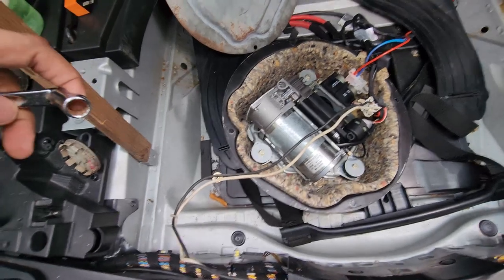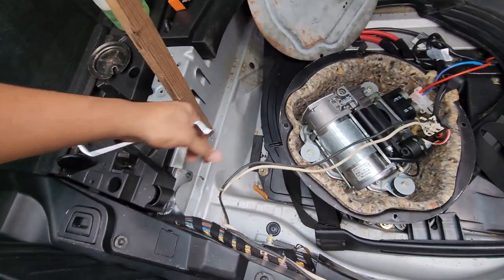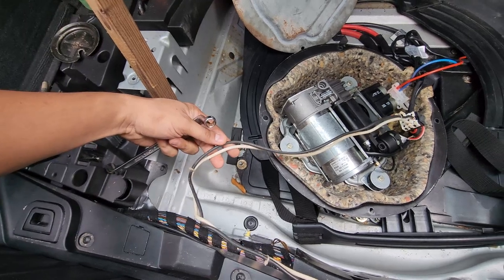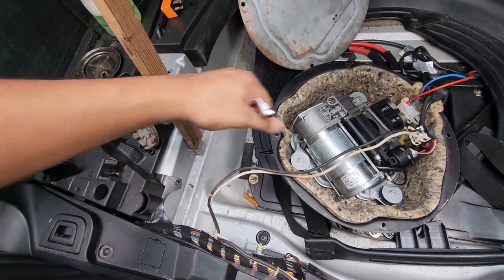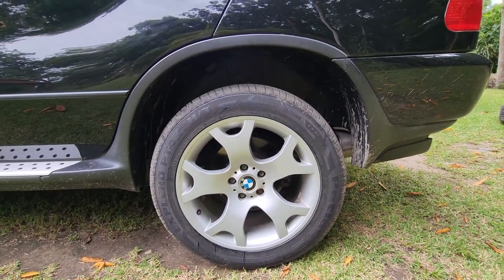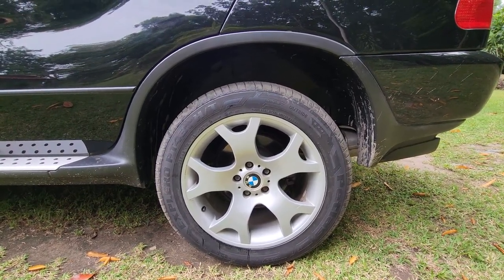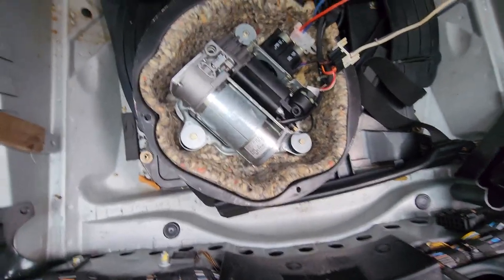Check in on your compressor — if everything's fine, this is going to get very hot so don't touch it. Check your wires; make sure you have thick enough wires — if they're not thick enough they're going to overheat. Make sure they're at least as thick as this one here, or even thicker. Now at 15 minutes, I'm happy with that — let's turn off the compressor.